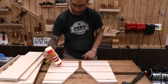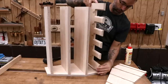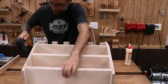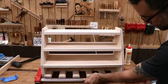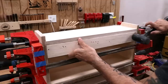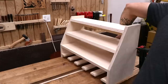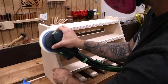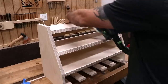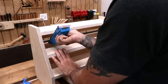Now we can glue this thing up. All we need is some Titebond glue and some clamps. At the back, I'll add two cleats that'll help me attach the unit to the wall. The fit is snug and there's plenty of glue, but I'll drive a few brad nails for additional reinforcement — a few screws wouldn't be a bad idea either. If there are any discrepancies in the front, you can smooth it all out with sanding. There's really no need for edge banding, though you could add it if you wanted to. Most people actually like the look of Baltic birch edges, but make sure you sand all of the sharp edges into a chamfer or a roundover — otherwise they're likely to split and tear over time.